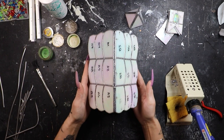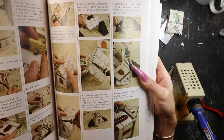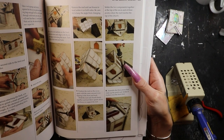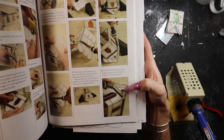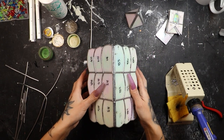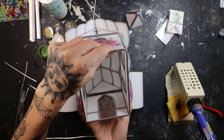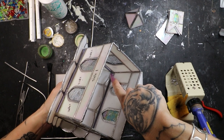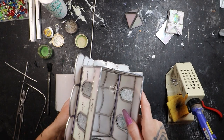I'm going to flip this thing over and solder that inside seam. That is feeling pretty solid. We're going to put the roof essentially back on the house, flip it upside down, and solder it firmly in place everywhere we can. Solder the two components together at the top of the eaves and at the three points where the roof touches the top of the church. Assemble the three pieces that make up the porch roof and solder it in place. We didn't do the porch roof, so we can skip that part. I'm going to drop a couple larger beads up where the frame of the house meets the roof on these inside corners for some added strength.